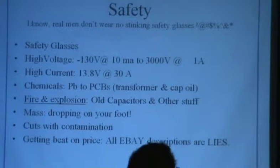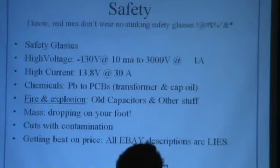At the very least, bring it up nice and slow on a variac and see if you get any jumping current. If you don't, maybe you can play a little, but you're going to spend a day or two doing it, just bringing it up real slow to reform the caps. Otherwise, you better replace them. And if they blow up, I think you'll agree that can be a very interesting and unpleasant experience.